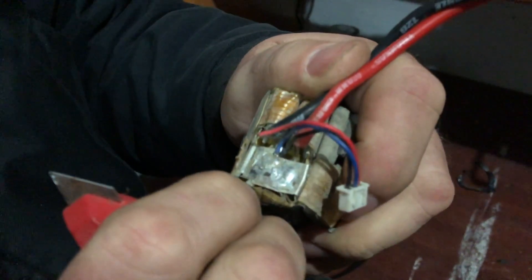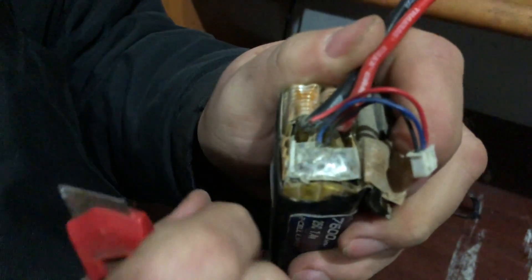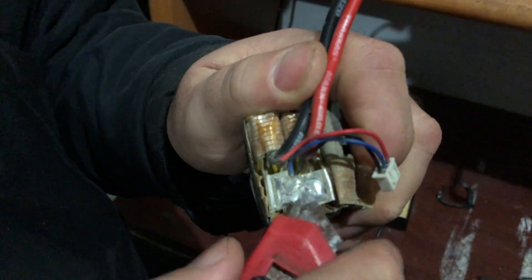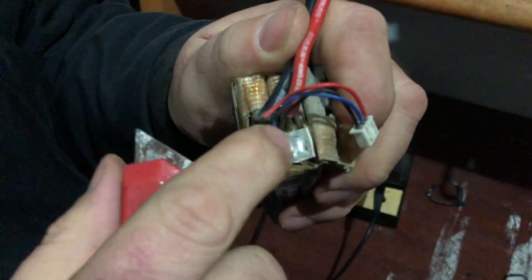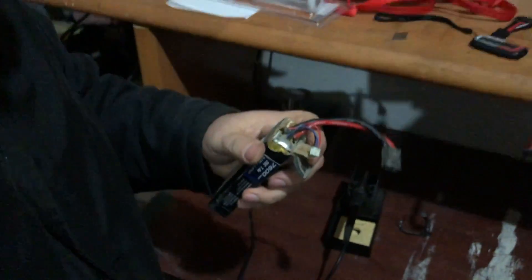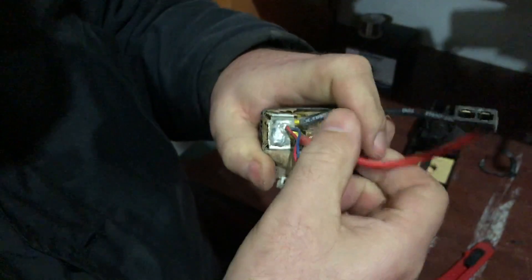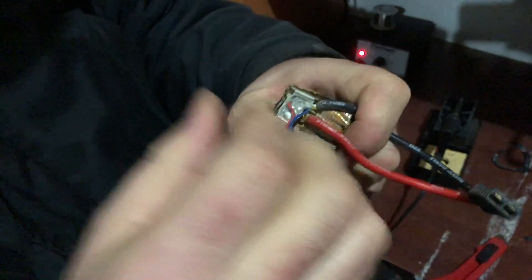Usually you can see a little tab or where it was actually connected. Is that a metal plate covering it up? This is the stuff that is very hard to solder — you need a very hot iron to actually melt it. I just need to find out where it was connected, then connect it and re-solder it. It might be on the other side. Anyway, that's why that balance lead doesn't work.